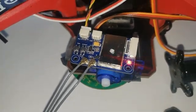Now remove the battery again. With the transmitter still on, plug the battery back in with the throttle all the way up. Now we're ready to do the all-at-once ESC calibration. Hit the safety switch and you'll hear a beep — that beep has primed the system and told us we're ready for the all-at-once ESC calibration.